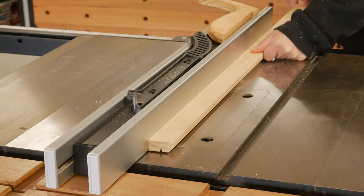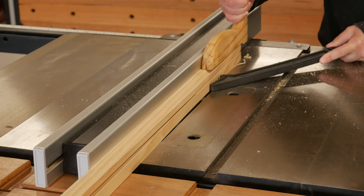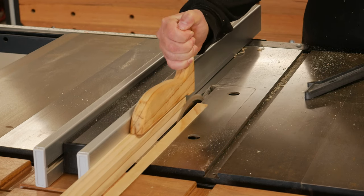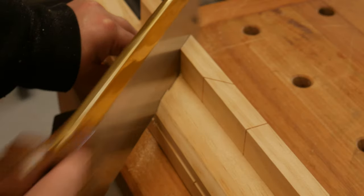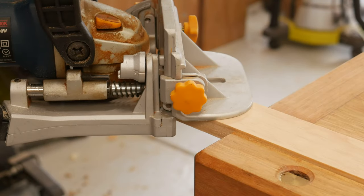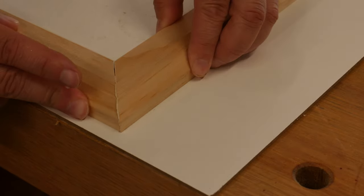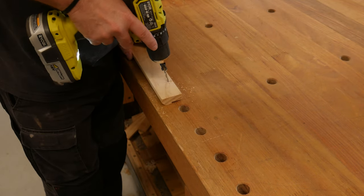The little designer decided she wanted a moulding placed on top, and she was undecided on colour, so we made it out of pine so it could be stained later. First a chamfer was cut on one edge, then a rebate to the underside, then all cleaned up with a bench plane. The miters were cut and trued up at the shooting board, then a biscuit was used to glue up a U-shaped moulding. A series of countersunk clearance holes were drilled so the moulding could be screwed in from on top.